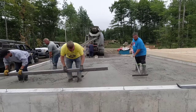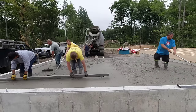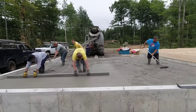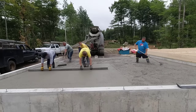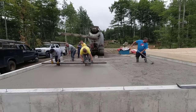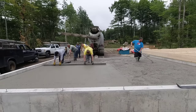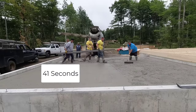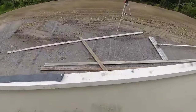Each section of this we'll call a bay. So we're going to screed down this one bay right now, and over there where Eric is to the right kind of puddling the concrete, that's another bay. This is kick screeding — that's a 12-foot screed, two guys on a 12-foot screed. I know a lot of guys just do it by themselves, but they don't do it this fast, especially with two guys raking behind you that know what they're doing. And when you don't have to stop, you can screed. That bay is roughly 12 to 13 feet wide by about 13 feet — so about 150-ish square feet right there done in 41 seconds. And no one's doing that by themselves with a screed. I don't care what they say.